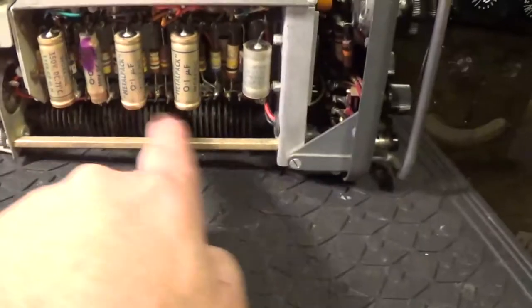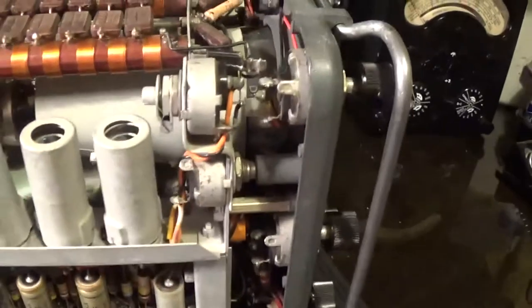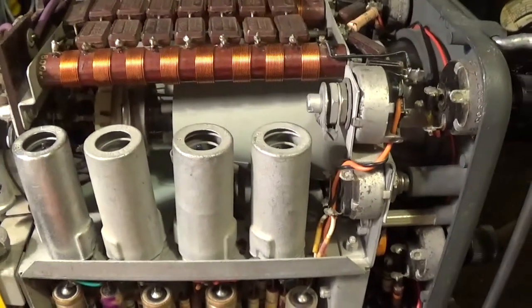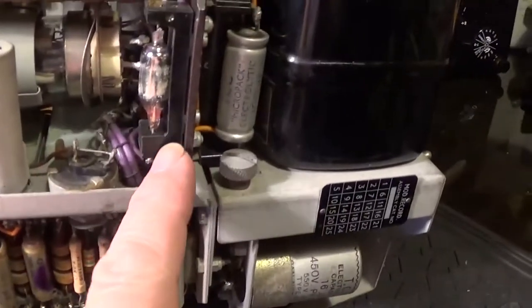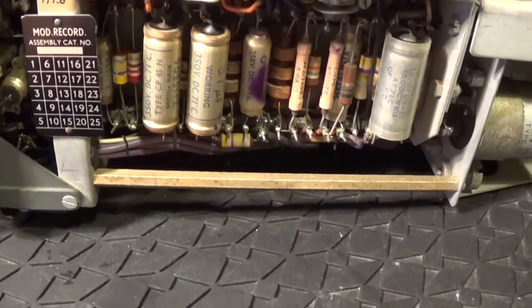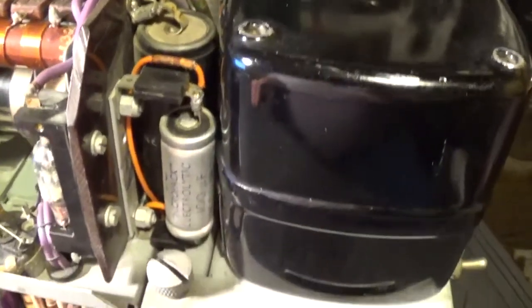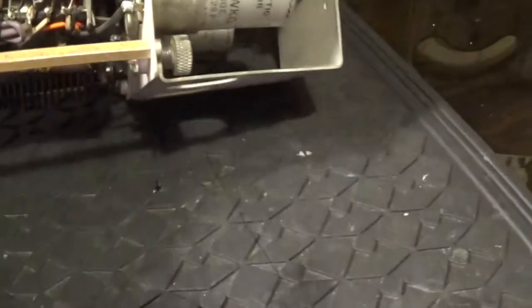It's got a big metal stack rectifier along here. And you can see the tube — the tube ends there, that's about five, six inches long. Let's switch it round and look at the other side. There's a double diode in that glass envelope. You can see the MOD mod stamps. No leaky capacitors, but it sure isn't running right. The trace flicks up and down of its own accord, and it's not all the way across the screen.